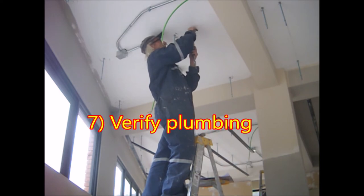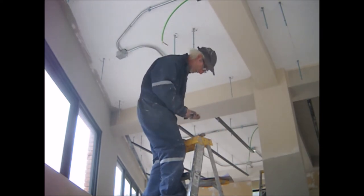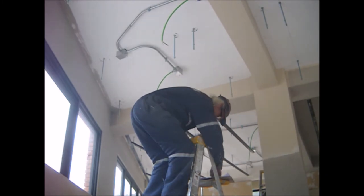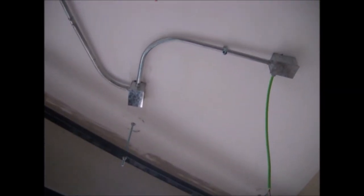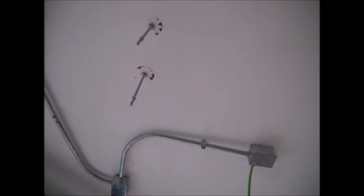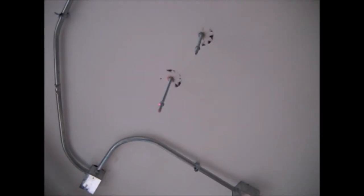Now we'll measure the angles so we can see which tool is the best. We have two ways to measure deviations, a good square and a laser level. To set the drilling points, we use a self-leveling laser. First, we mark the points on the floor according to the ceiling plan, placing the laser over each point. The laser transfers the position of each point to the ceiling, where I already have made the holes. That's how we marked on the ceiling where we had to make the holes.